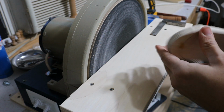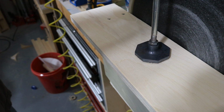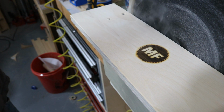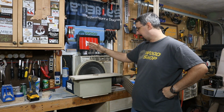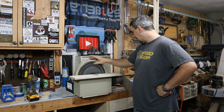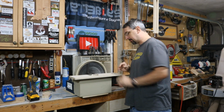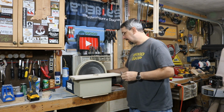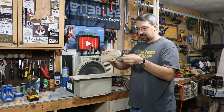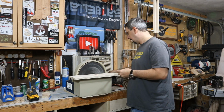Then you have magic. Magic. Okay, I got the disc sander done. It turned out fabulous. I love it already. Everything is square to the table. It is perfectly 90 degrees, the bed to the disc, which made this cut perfectly square and rounded like I did a test piece on.